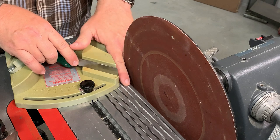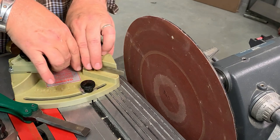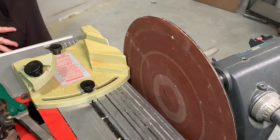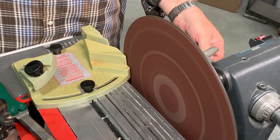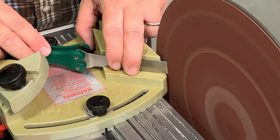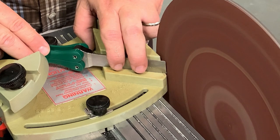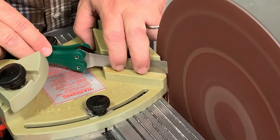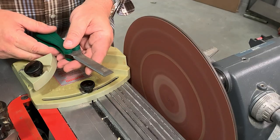I could tilt this to a different angle, but now I'm over the table and I've run out of chisel — I can't bring that forward. I don't sharpen my bench chisels with this jig, but let's just see what happens. Let me lock that down at zero and cover the way tubes so we don't damage those. It's really hard to not push that out on the disc. Here we're actually grinding a whole new bevel onto that chisel. It's not the way I want to sharpen bench chisels.